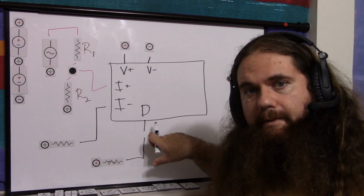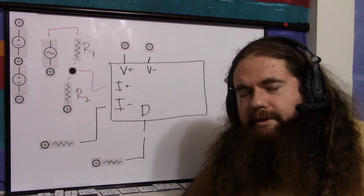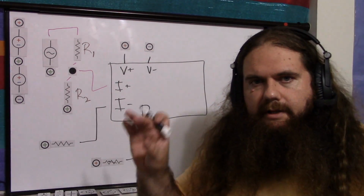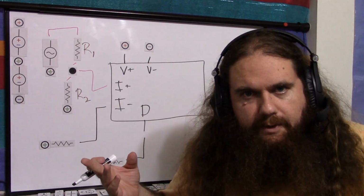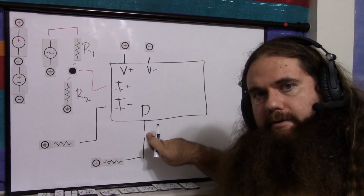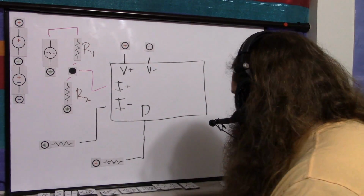You measure the current, amp meter, and you look on your data sheet and you see that mine says the diode input current should be absolute maximum rating of 2 milliamps. And when I look further in the data sheet, it says 1 milliamp is pretty good. So we say 1 milliamp is pretty good. So you put in your amp meter, and then you adjust your variable resistor until your amp meter is reading 1 milliamp. So then you know what value that resistor should be, and you put it in.